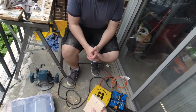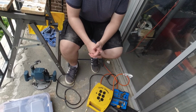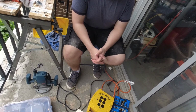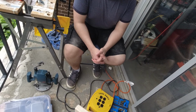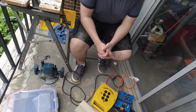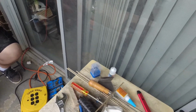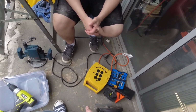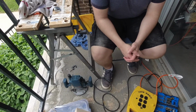Everybody? So now we're just gonna kinda fix these up a little bit so we can get the brass rod to fit in here. We'll come from the front, from the back. We only have to take off like 3, 4, 5 thousandths. Yeah, see that? You see that it's totally flat now. See, that's how it'll sit. So we're pretty much done with these.